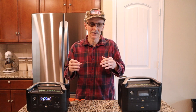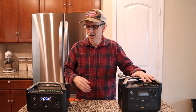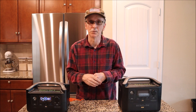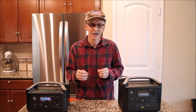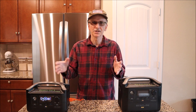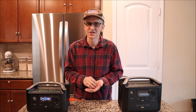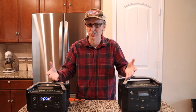Most people take the watt hours per hour on average and divide it into the battery capacity to find out how many hours it will run. But that's not entirely accurate, because the portable power station has to use some of the battery to run itself — that's a matter of efficiency. You want to know how efficient your unit is. Research what is called the inverter efficiency or battery efficiency for your unit, to find out how many watt hours you actually get to use. That's what matters.